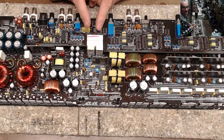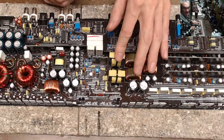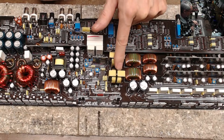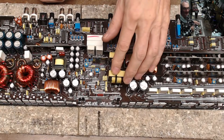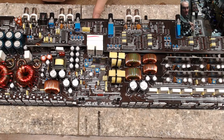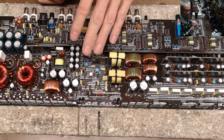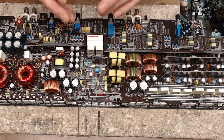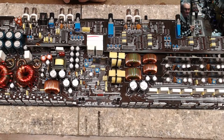So I don't think I have shorted inductors here. Usually the transformer winding tape will be brown and discolored if it was shorted, and I don't have any shorts on the output terminals. The snubber network is fine, no open resistors. I could not find anything that was wrong — I could not figure out why I was getting heat right here.